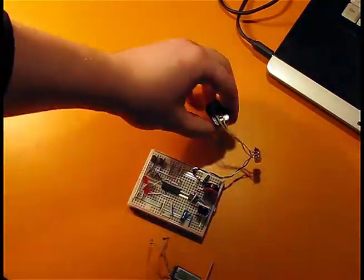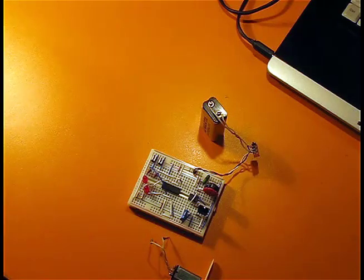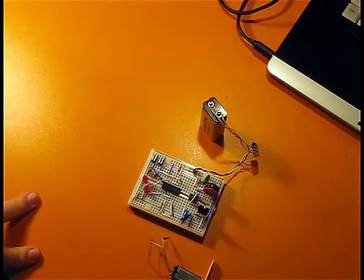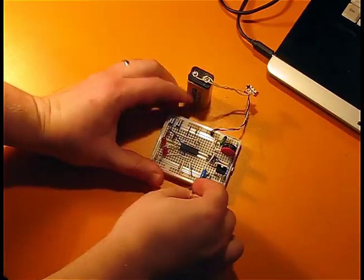Okay, why use pulse width modulation? What is the purpose? Well, the purpose is to provide small impulses to my circuit, because in the digital world we have zero logic and we have high logic. We don't have intermediate values. Then we will modulate the duty cycle of a square signal, so that the root mean square will have intermediate values for our voltage. Let me connect the DC motor to the circuit.